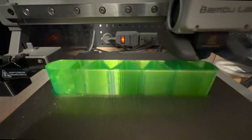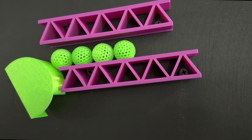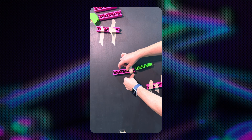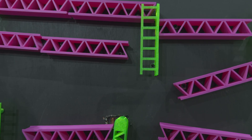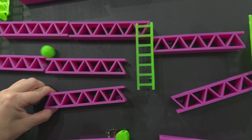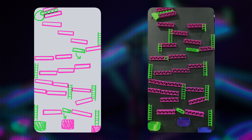After a few days of printing, everything is almost done and it looks pretty good. I started by testing the ball dispenser — this is super satisfying, I could watch it all day. I used masking tape to temporarily hold everything in place, then secured it all with screws. I did run into a small problem though: one path was supposed to bring the ball straight down or to the right, but a little screw was bouncing it off to the left giving an unintended victory. The fix was simple — just add an extra rail on the left-hand side. Now let's see how the final version compares to the mockup — it's pretty close, with a few extra rails added for polish and a couple of angle adjustments.